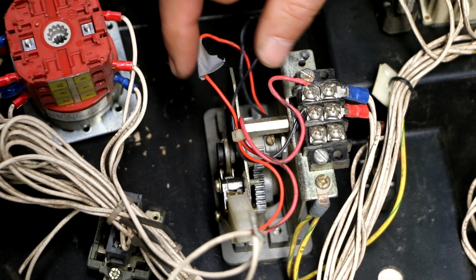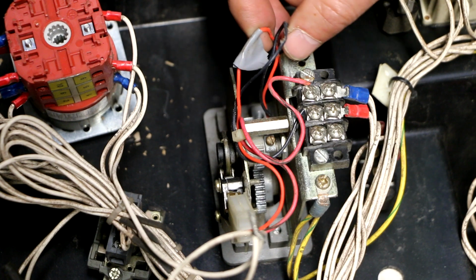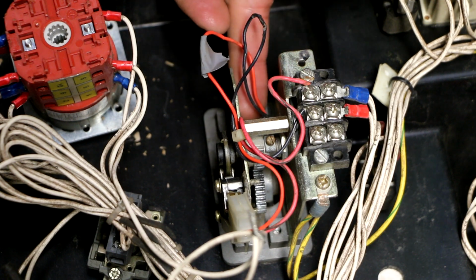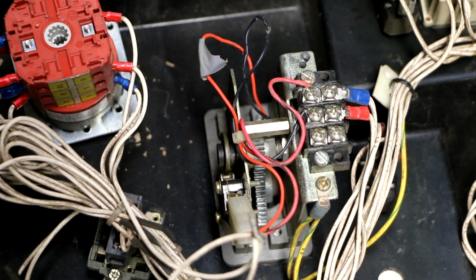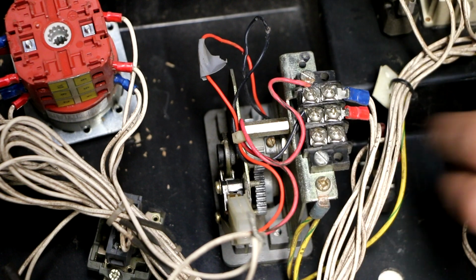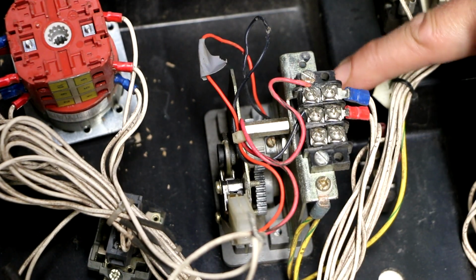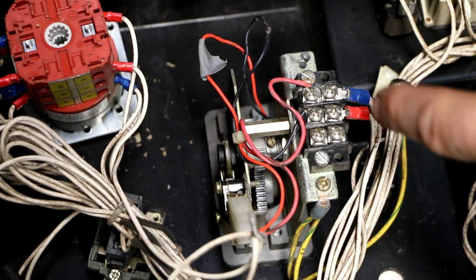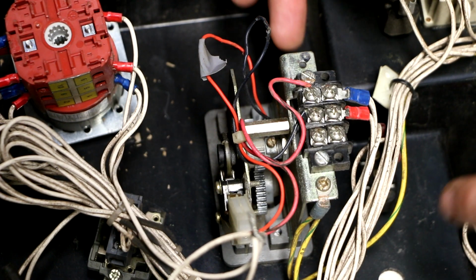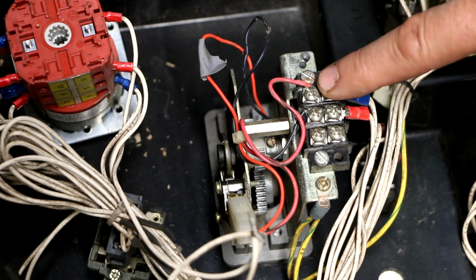It seems to me like originally these wires probably were anchored in a way so that they couldn't accidentally get pinched in this gear, because what's underneath here is a sector gear, and when I move the lever, that's rotating a shaft, which is rotating this electrical device, the mystery device I was talking about. So the switch and whatever signal comes from this electrical device all ends up going out on 2 connections. That's it, right here. This is not used.